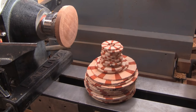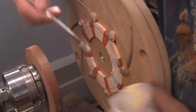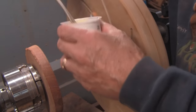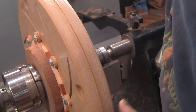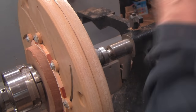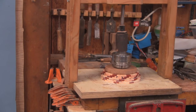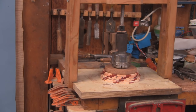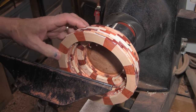I've got all the discs re-sliced using my bandsaw sled. Now they need to be glued onto that piece of mahogany in my chuck, which is going to be the base. I built this Longworth chuck for locating and gluing segments. I made some real short buttons just so there was no interference as I stacked them into place. As soon as I have three or four rings glued together at the lathe, I move it over to my glue press and clamp it down real tight. I have nine of the rings glued on here now, the ones that are down to 200 thousandths.